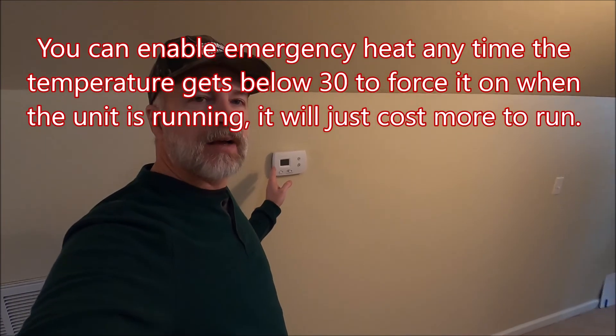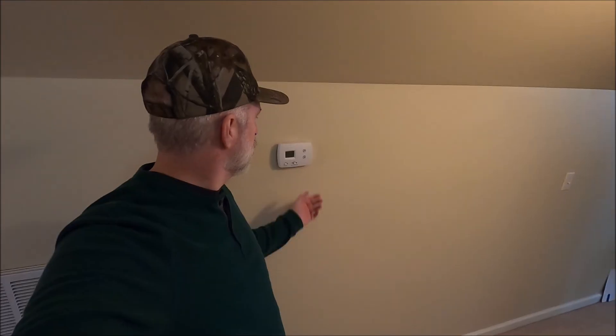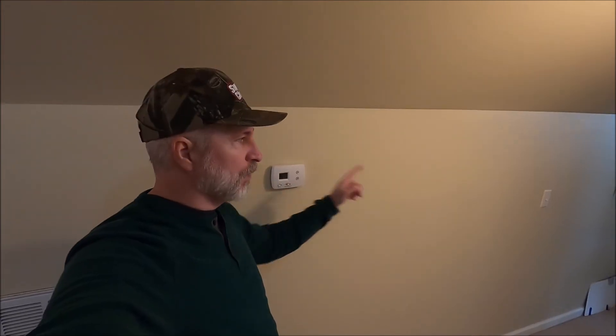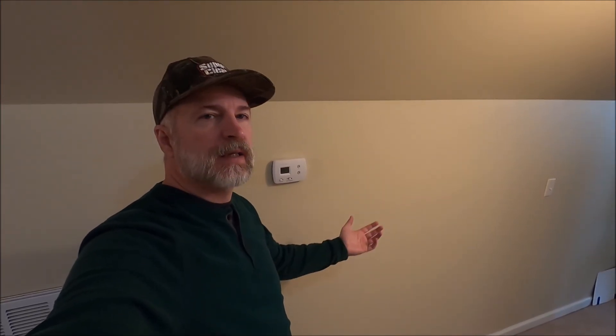What I suggest: watch your thermostat when it's cold and make sure it's keeping up and that it's not freezing up outside. If that's the case, you should be fine. However, if something happens where it's not keeping up — or maybe the outside unit got damaged by a tree limb or something falling on it — then you want to manually flip it over to emergency heat. That way, when the temperature is below what it should be, it will use the electrical coils to supplement the heating. And if the outside unit has been damaged and the heat pump itself is not working, that will give you some heat until you can have someone come and repair the unit. Hope that was helpful — if so, please like, subscribe, comment, and good luck with yours.